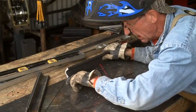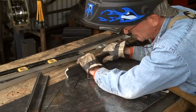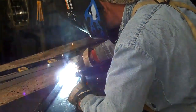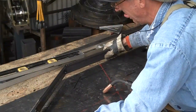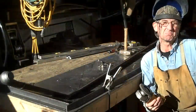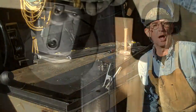I'm just going to take and use this angle I already laid out on my table, hold these two pieces in place, tap it here so I know I've got the right angle, and just double check it before we weld it off. Alright, the next thing we need to do is take our grinder and start cleaning up these welds.